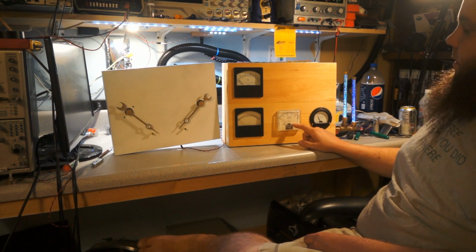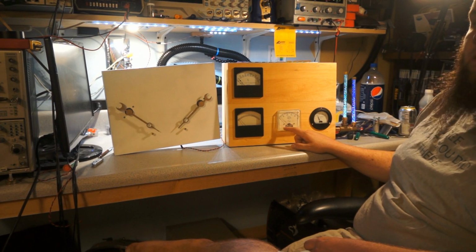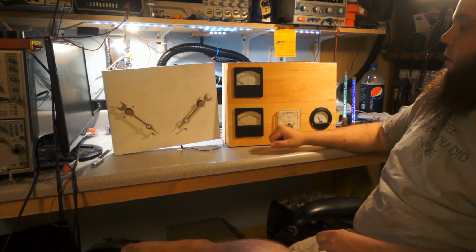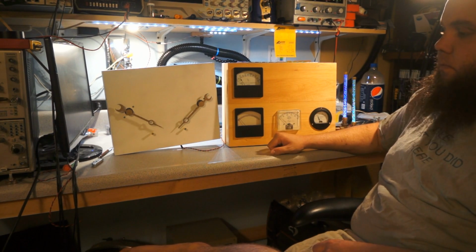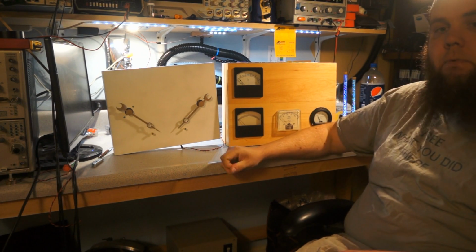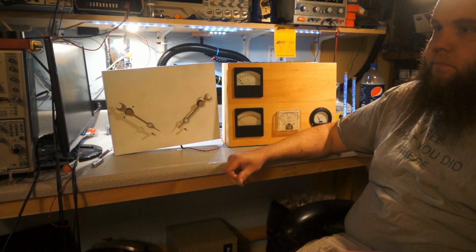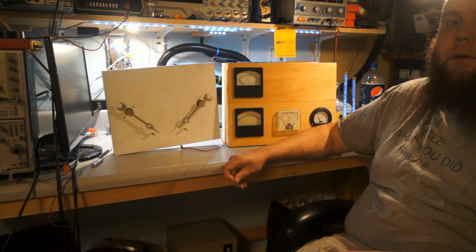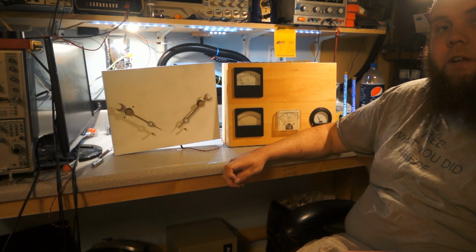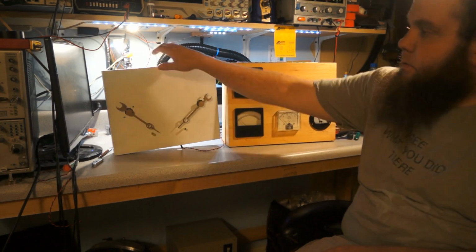My router is a box running pfSense, which is a BSD based, kind of a BYO router, and there's a module that you can grab for it that uses LCDproc for displaying on like a little LCD. I've got a very irritating custom build of LCDproc that doesn't try to send HD44780 command codes over the serial interface.